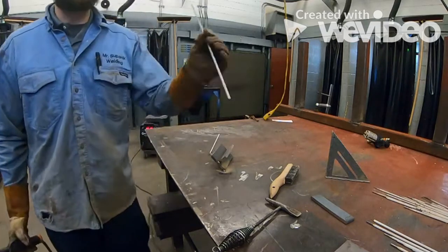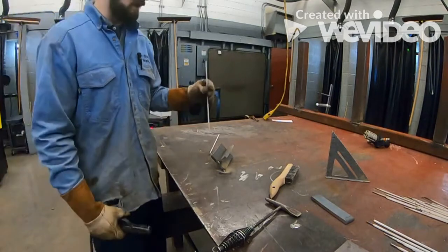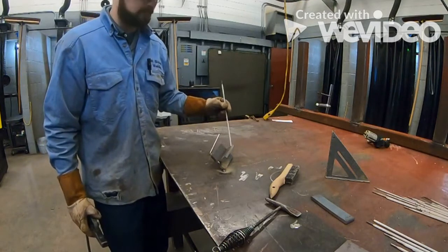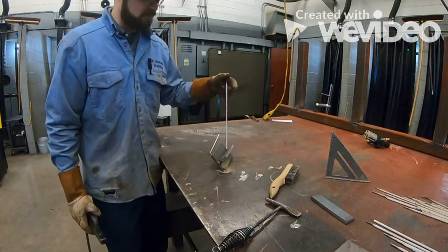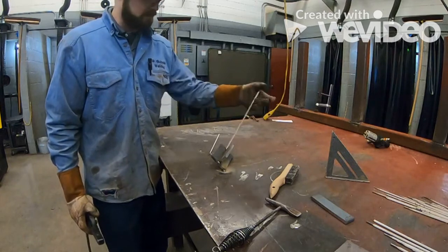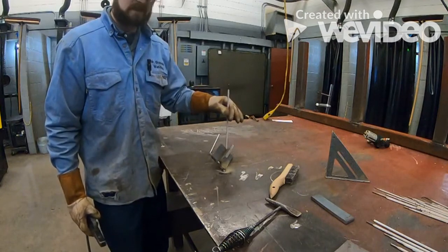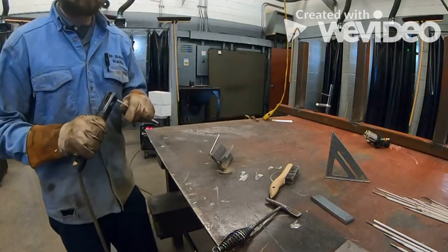Okay, same thing. We want to get rid of that solidified slag that's on the end there. And this first pass, okay, this joint itself is at a 90-degree angle, okay? First pass that we're going to do, we're going to split that right in half. So we're going to be at a 45-degree work angle, okay? Because this would be 90 degrees. So this is technically a 45-degree work angle, okay? With a 10 to 15-degree travel angle, okay? We're going to drag it right along here, okay?